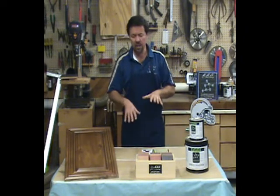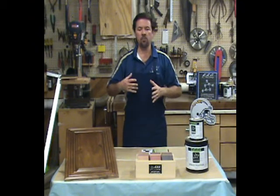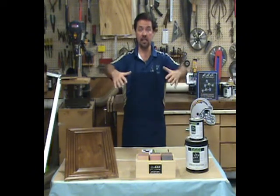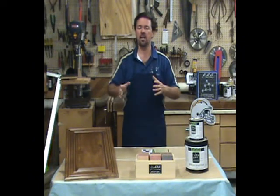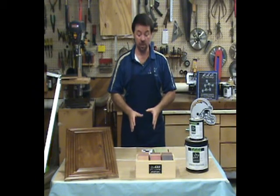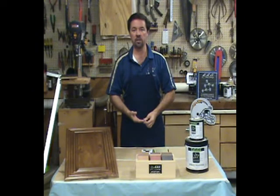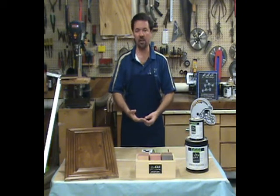So just again, with a background on this, it's a complete line. One of the real negatives that's always been out there with waterborne coatings is this manufacturer makes this one clear coating. This guy will make a pigment. Nobody makes a complete system to replace lacquer. So everyone was cherry picking little bits and then they'd go back to solvent, and it was just not a cohesive system for them to use. That was paramount when we built this product. It is everything from stains, gel stains, toners, multiple clear finishes, pigmented coatings, primers, sanding sealers if you want them, not necessary, but if you want them.